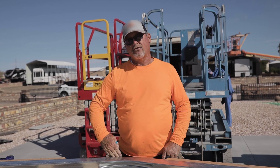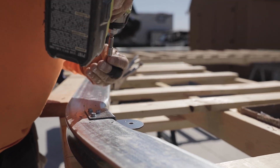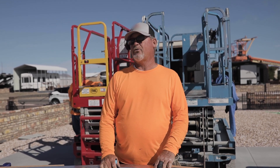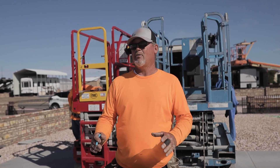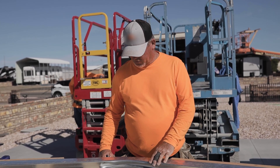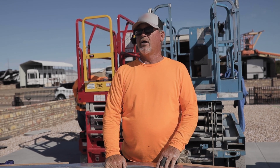That's why we find the center of our trusses — because that radius is so wide, you're never going to eyeball it; you're going to be off somewhere. So that's the quick thing we do: 51 and 5/8 on the two-by-fours. The two-by-threes are different — I think it's around three-eighths or something like that. Anyway, that's the purpose — I'm making a mark right there so we can string-line our lines. You'll see that in a little bit when we stand them up and do some string lines.